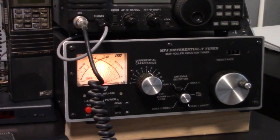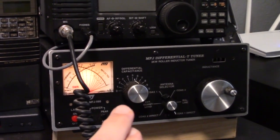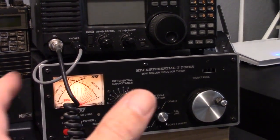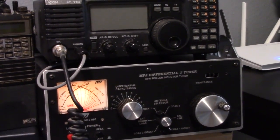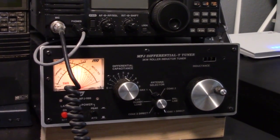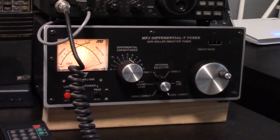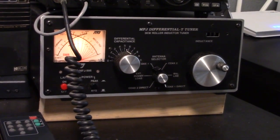Right here is an antenna tuner — this is the differential T antenna tuner. You've only got two controls: capacitance and inductance. Normally a T-tuner would be capacitance, inductance, capacitance, but this works on a butterfly configuration, so it's a little more fidgety but you only have two controls. It is way too big for the shack I have, and I could use a much smaller tuner. But back when I was using the doublet antenna, having a nice beefy tuner was a good thing, and this works great so I'm keeping it.